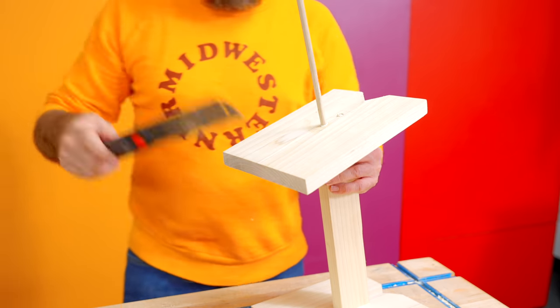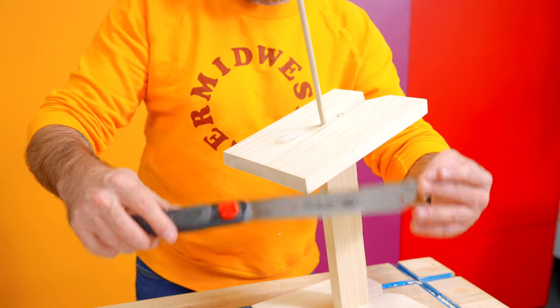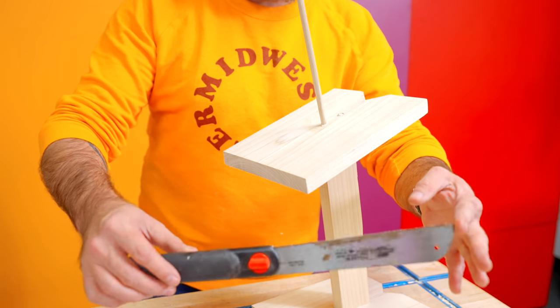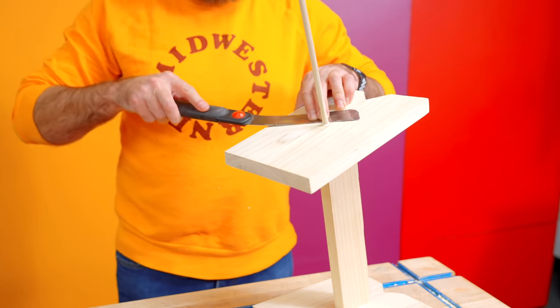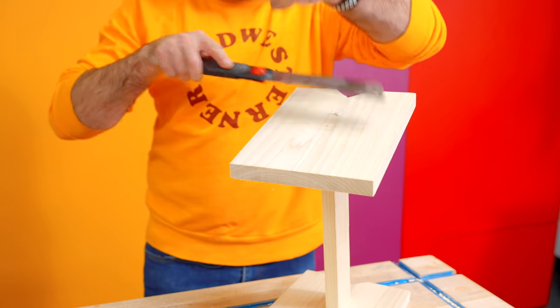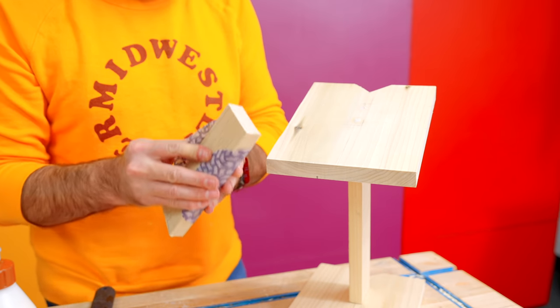I have this flush trim saw. This gets a lot of use for things like this. That's why you see all that glue on there. This is relatively inexpensive and it's a nice tool to have because you can cut flush with the face without marring up the face. I can take a scrap piece of wood, wrap some sandpaper around that,